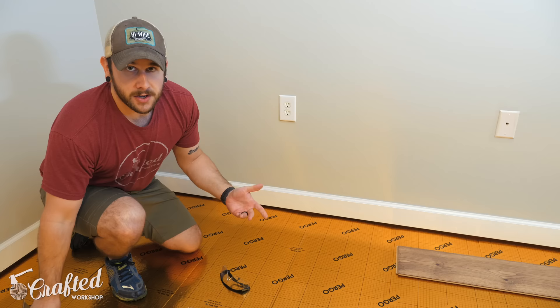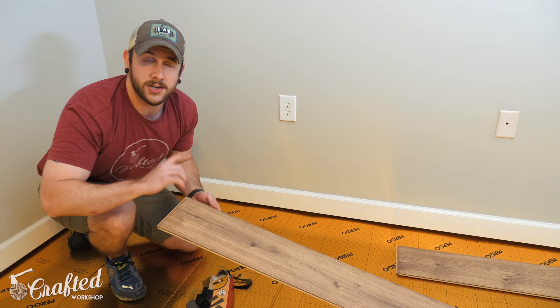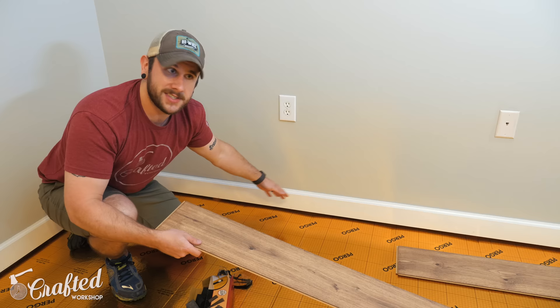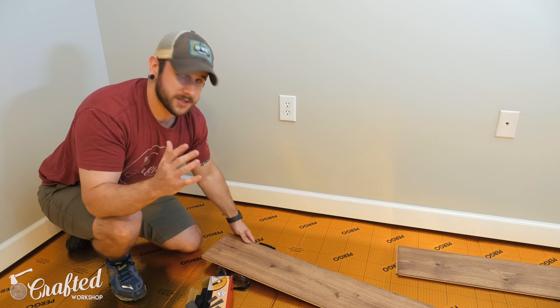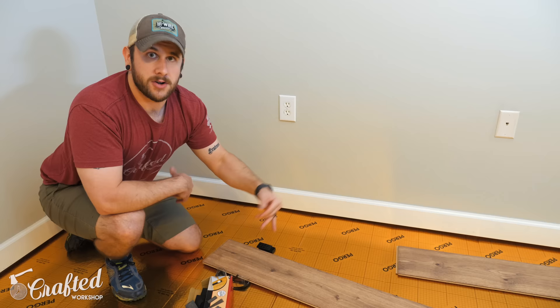What I'm going to do is go ahead and cut off this end over at the miter saw, and then I'm also going to rip off the tongue on these inside edges on this first row at the table saw. The final thing we want to do before moving over into the shop is measure the length of the last board in this row so I can cut that to length before ripping the tongue off of it, so that I can then use that cut off in my next row to get that nice staggered joint.